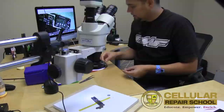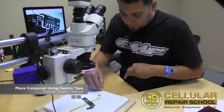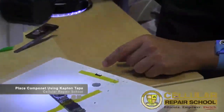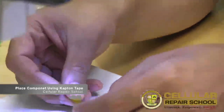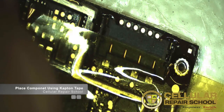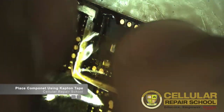Just be patient with me — let me put some tape and I'll show you here in a second what I'm doing once I get back under the microscope. What I have here is a nice little trick: I applied tape on half of the component to help me align it and keep it stationary. I'm going to place it where it needs to be as best I can, then tape it down so it's not moving when I use my hot air tool.